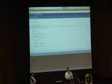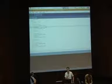So if we send a value of 1, it means we want to pulse the first output. And what it does is do a digital write, so it sets the output on that one to high, waits for 500 milliseconds, so it's half a second, and sends it low again. So basically what happens is that by sending a value of 1 down the serial port, we cause it to send the output high for half a second and then drop again. So it's simulating a button press. And it has 3 outputs, so we can then control 3 different things. So in this case, I've got 2 relays wired up, so we can control 2 different things.